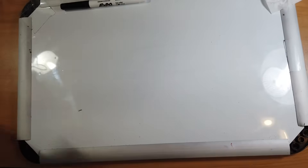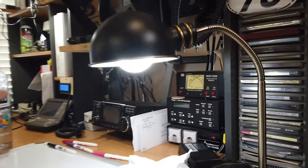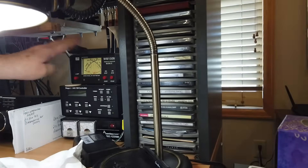What I would suggest you do — you've got all the other things: your HF transceiver, which is an FTdx-10, a high-end radio, a DC switching power supply, the SCC-1235M as the reference station power supply, and an SWR meter with a separate sensor that you do want to ground. Now for the computer, you've got an iMac desktop. I think I would leave the computer grounded to the utility ground through the three-wire plug, and then let the USB act as a buffer between that and the radio. Keep the two far enough apart so you don't get RF into the line.